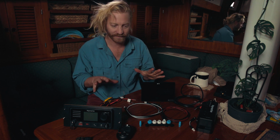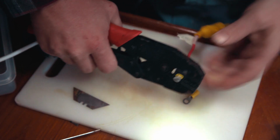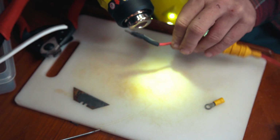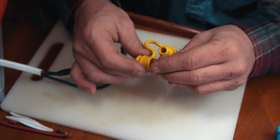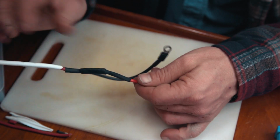The bare basics of this is going to be how they all communicate. When it comes to the powering up, what you want to do is make sure that you're safe. So you want to disconnect the batteries, you want to turn all the power off before you start to muck around with any kind of electrical systems, and use plenty of fuses. So every single item that you're using should have a fuse.